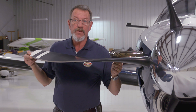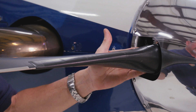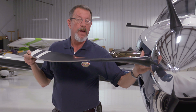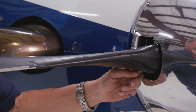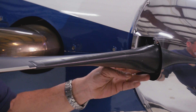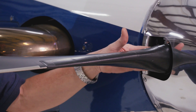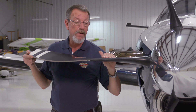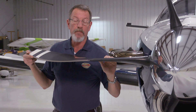Next, you'll want to inspect for grease or oil leakage. The grease or oil leakage will generally be seen down in the shank area of the blade where the shank emerges from the hub. It may appear at times to be oil, but that's generally caused by separation of the grease during warm weather. A small amount in the shank area is generally acceptable. It becomes unacceptable when the grease or oil is spattering out on the blades and/or impacting the windscreen, which will generally require the propeller be disassembled and repaired at a propeller repair station.